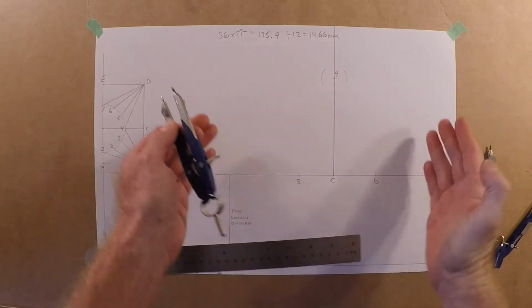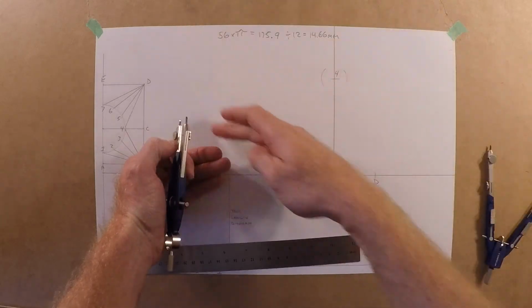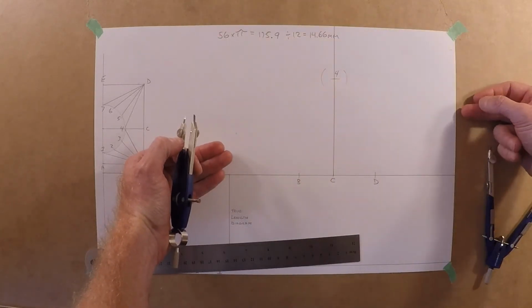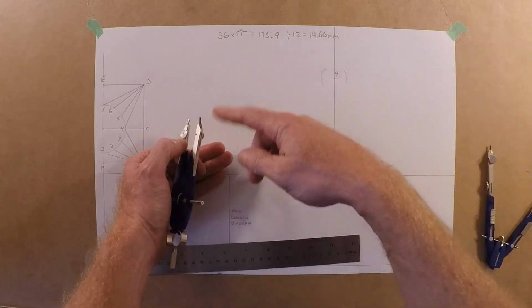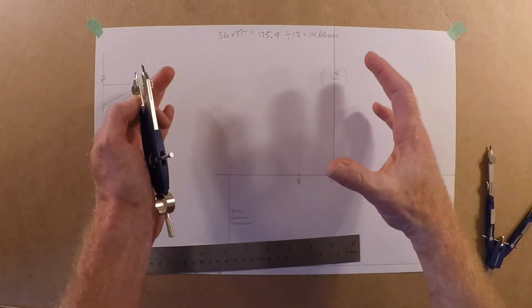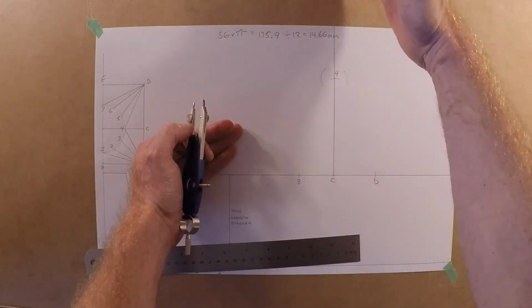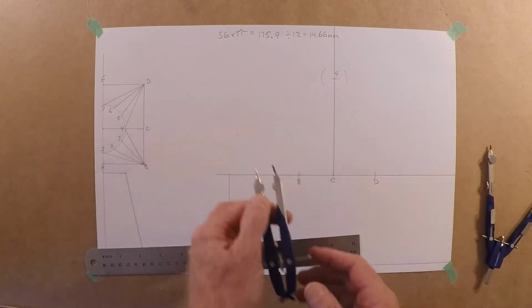In this one here, we're not going to be able to bring this up to the center like we did the last one. And we're not going to be able to double check here with the radial line. Because remember, when it was on center, we were able to do the radial line, and even on the top. Not so on this one. Once they're off center, it shifts, it's not concentric. You can no longer do that. So we're going to have to snake in the top. That's the only thing about that.